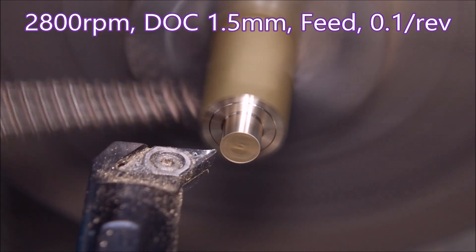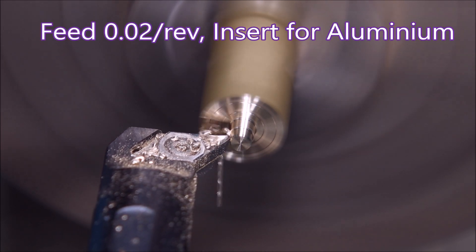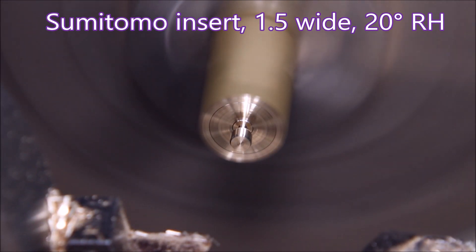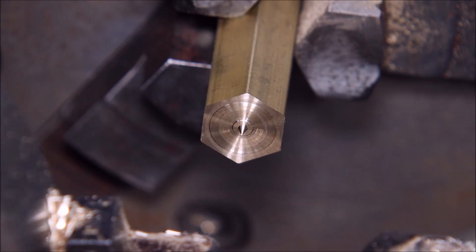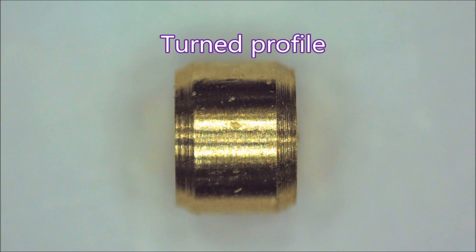In the previous bush, with that stock removal cycle I actually trimmed the face off as well, so I stopped doing that with this one and just did it with the actual finish pass. This insert has a 20-degree face on the cutting edge, which gives you a very strong nib but allows you to get down to almost no nib at the part. That's the turned end — the finish is quite good, though it just looks terrible under a microscope. There's the turn profile.